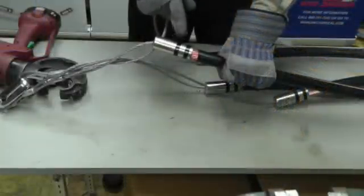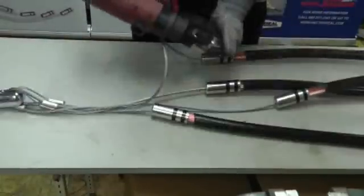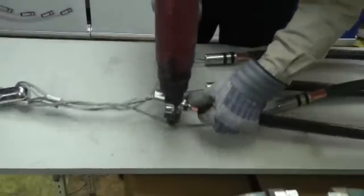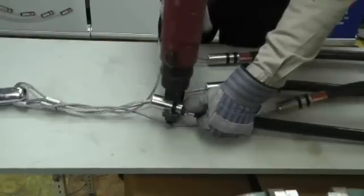This is a black color band. This is a 750 MCM cable being crimped into a 750 MCM shell. I'm using a 750 MCM die set. You would insert it into the die tool, line it up with the color band with the center of the crimping die, and then crimp.